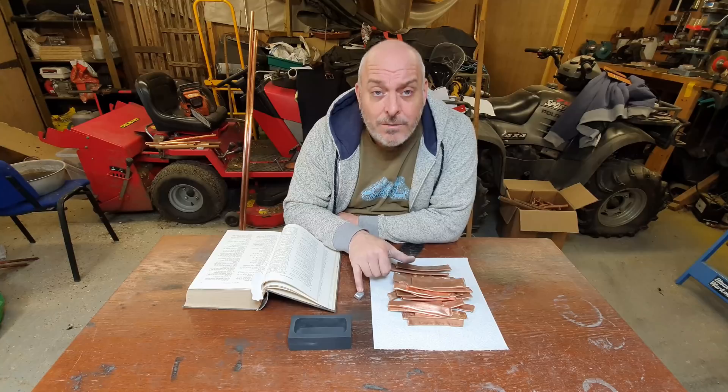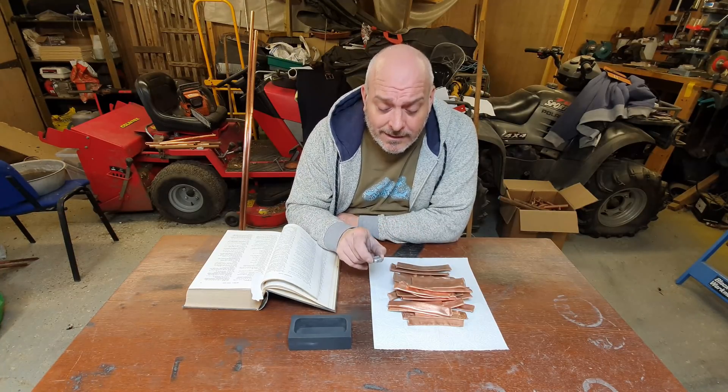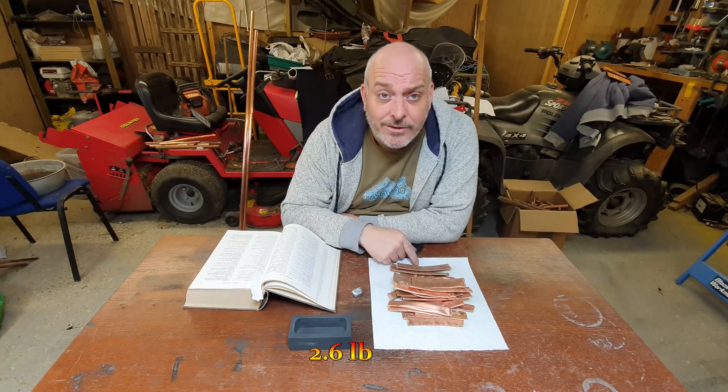This particular metal I'm going to make this week is Red Tombach of Vienna. Red tombach is actually a brass — it's an alpha brass — it's 97.8% copper and 2.2% zinc. So I have here 26 grams of zinc and 1182 grams of copper.